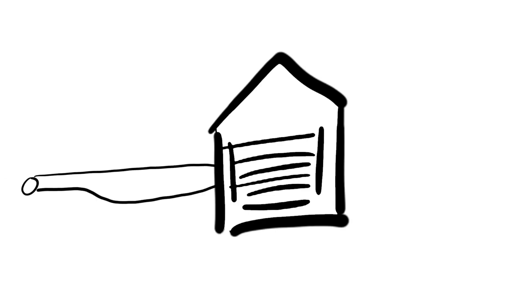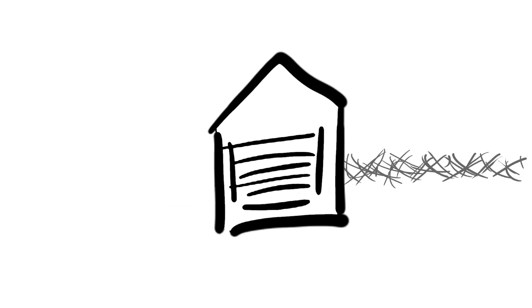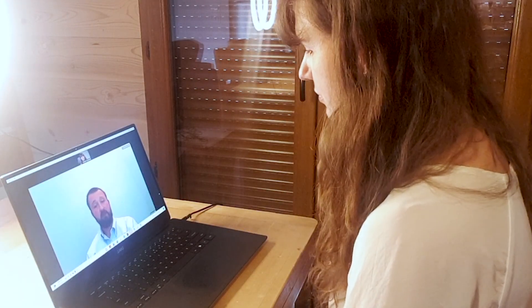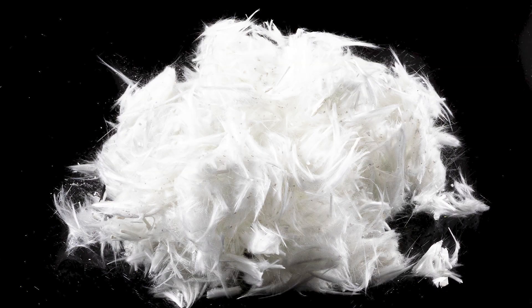It occurred to me that wind turbine blades from different manufacturers don't all use exactly the same materials. Even if they're all using a lot of fiberglass, different manufacturers use different resins — some use epoxy, others use polyester resins — not to mention other fiberglass products like boats and car parts. Will the plants be flexible enough to process all kinds? The process is material agnostic — I can throw in wind turbine blades, truck beds, basically any sort of polymer composite. The limitation is that wind blades start as continuous fiber composites, so shredding them creates discontinuous fiber, meaning they can't be immediately reused for the exact original application.